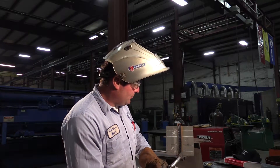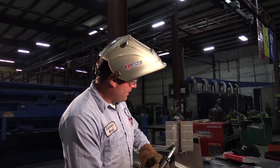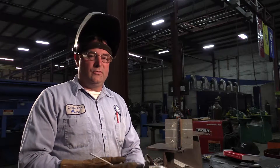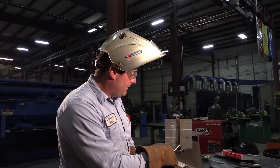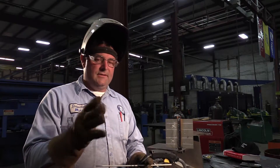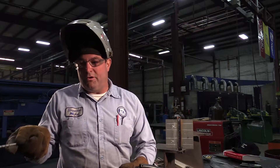With flux core I don't do any pausing on the sides. With the higher deposit rate I'm moving back and forth real fast — more like a robot would weld. I'm keeping my puddle that wide and carrying the whole thing up the hill. You won't see me pause over on the sides. Unlike 7018 Shield Metal Arc Welding, which has a much lower deposit rate, with 7018 I would come over and stop on the toe, let the puddle catch up, blow across the center fast, and pause on the other toe. The reason: the center weld gets twice as much coverage because I cross back and forth — like when I was a kid, the kid in the middle gets twice as much pop as the guys on the outside. I have to let that metal come over and fill out before I go back across, and when I go across I waste no time. Then I pause on both toes.